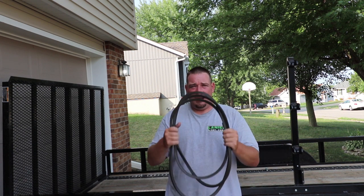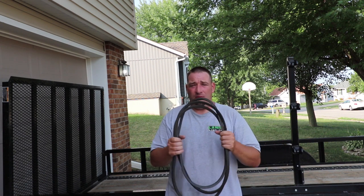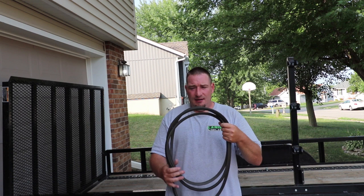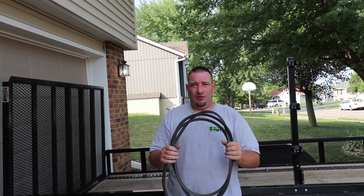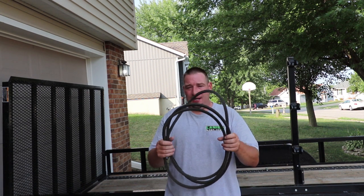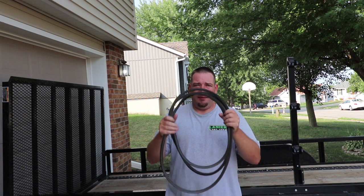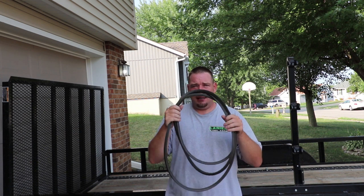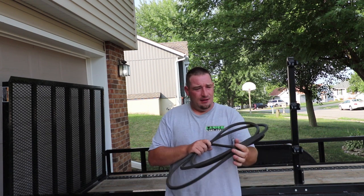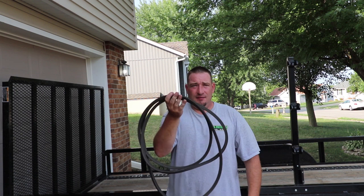The next step in my lesson learned is to buy a spare belt, because it's real easy to put on. I'm probably going to end up buying another one from Mocan Power Equipment again — Rob's been a great guy. Belt maintenance, guys — check the small things that you never think of. A lot of you probably think of this, but I'm spaced off worrying more about plugs and oil changes than the belt. Check your belts every 10 hours, every 20 hours. Before you load up in the morning, check them — it's a quick look over and then you're good.